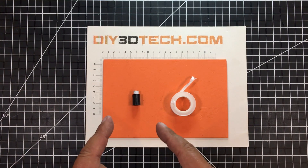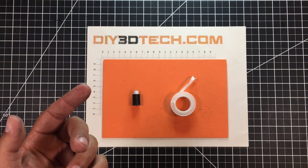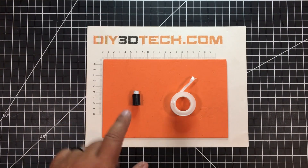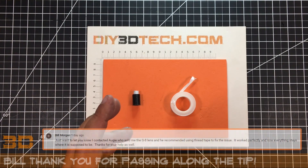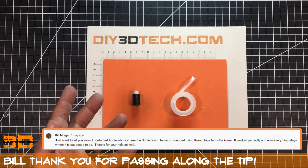So I've switched the G8 lens and it's a little bit loose inside the laser. The stock lens has this O-ring on it that kind of keeps it tight. Now what I've been doing is putting a little bit of tape on the barrel to hold it snug, and that's been working, but a viewer wrote in that he had received a suggestion to try Teflon tape and it had worked for him.